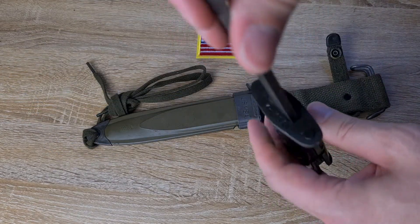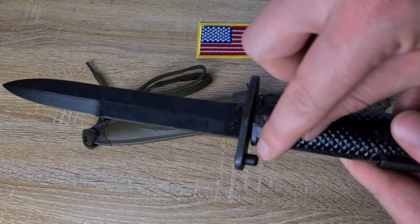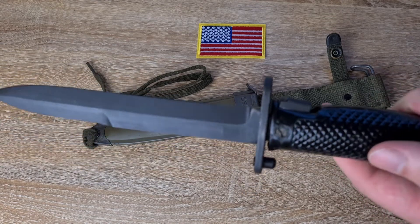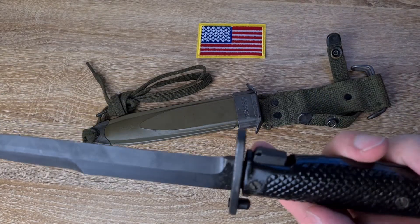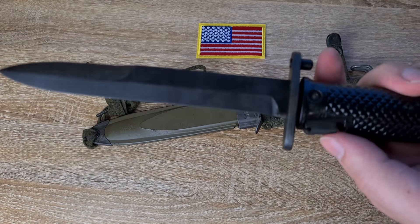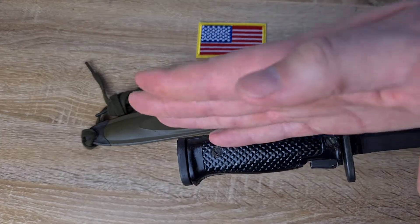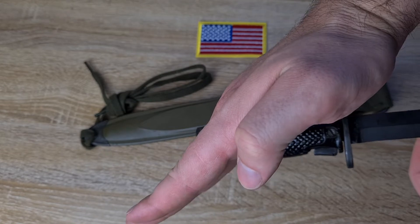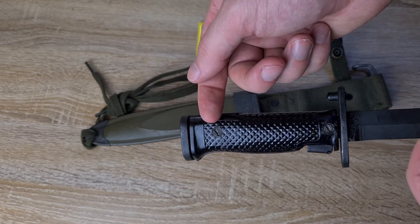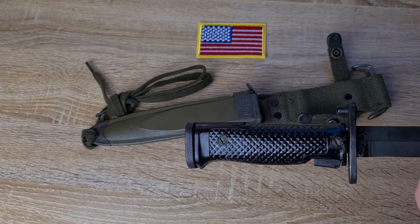On the cross guard, we have no muzzle ring. How can this be a bayonet without a muzzle ring? We have a little nub here which slots into the gas block on the M1 Garand — it snaps in, so you don't need a big bulky muzzle ring. Then we've just got plastic grips. This being the Korean version, the grips are a bit thinner and a bit flimsier, but it feels pretty solid. And then we've got a push button here for connecting to the rifle. When you press that, there's a lever inside the grip that pivots on a pin in the centre. When you push this up, that side gets pushed down, and there's a little catch that gets pulled down when you press this button and disconnects from the rifle.